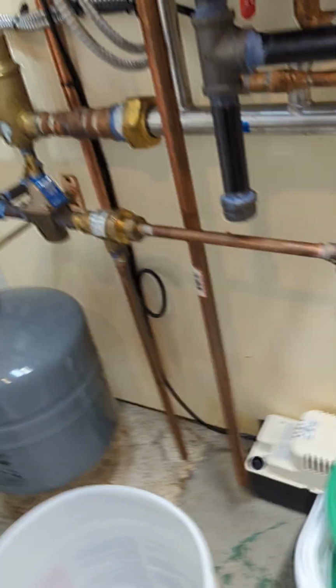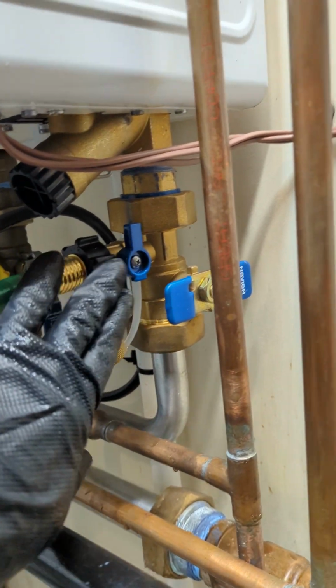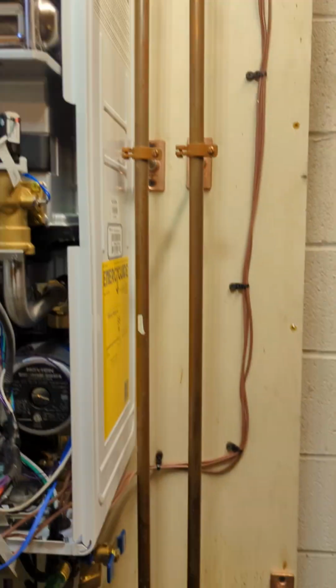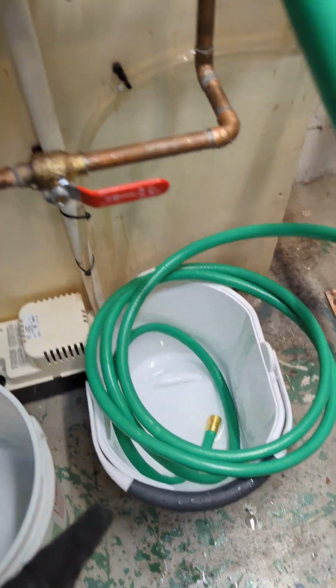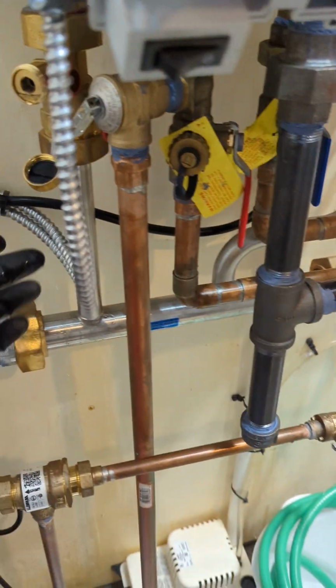When you try to drain the system, hook up the hose on the blue side, because that's the return area and that connects to the bottom of the heat exchanger right there. When you open it, it will release the water from that heat exchanger, and on the red side, that's the top side, it's going to suck in air so it doesn't create a vacuum.